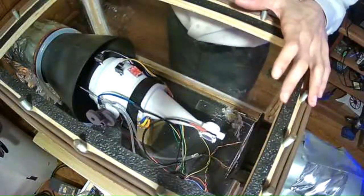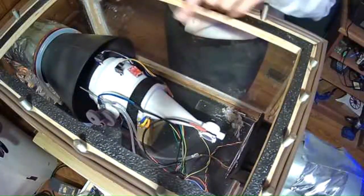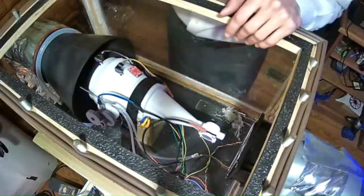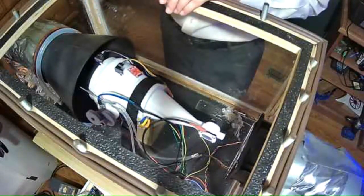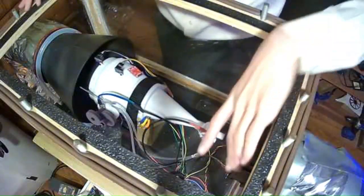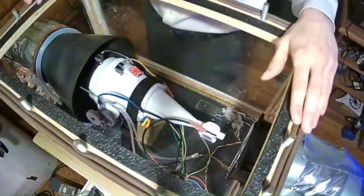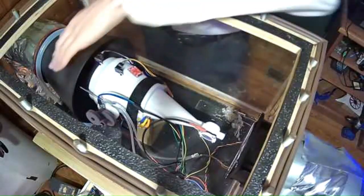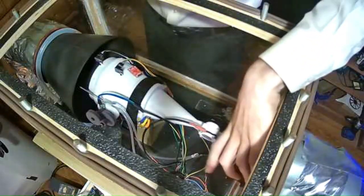The reason I did that was because I need more precise control over the differential for the speed. I don't need very fast speeds. There isn't going to be very fast air coming off this rotor. I need very slow speeds with a very tight tolerance between each interval that I can throttle on this fan, because this fan has 0 to 255 input in my code. So I have 255 intervals from 0 to full speed. And so this will give me a tighter differential in velocity than if I had run it without it.